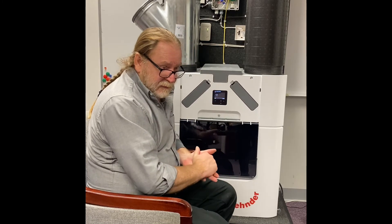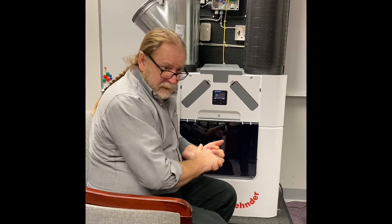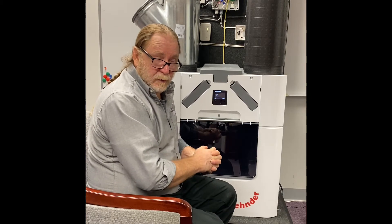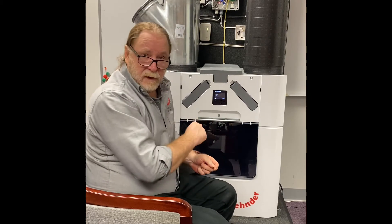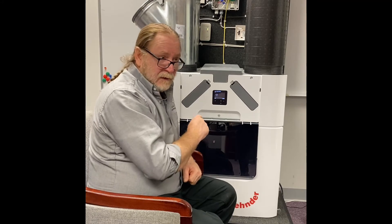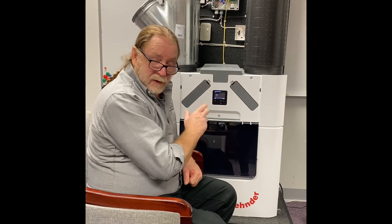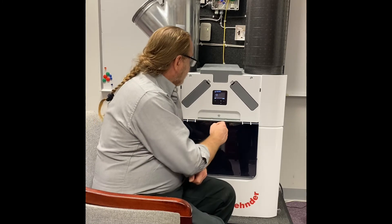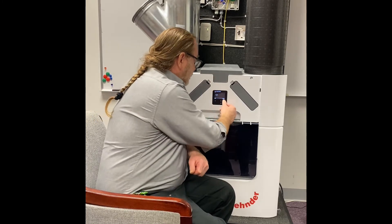Is there a fireplace present? If there is a fireplace present, say yes. We want the unit to know there is a fireplace so that the unit will never go into a negative disbalance and draw gases back into the house. In this situation, there is not a fireplace.